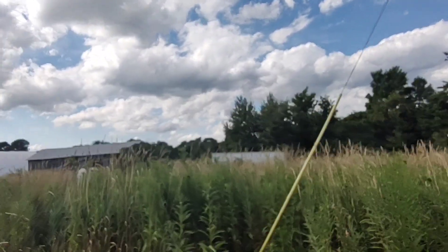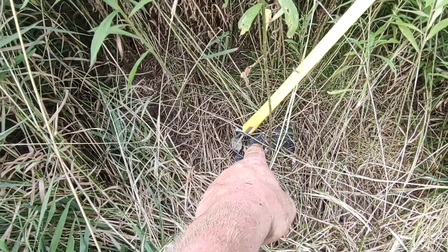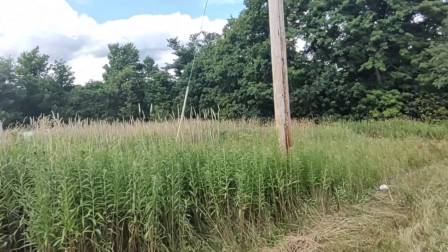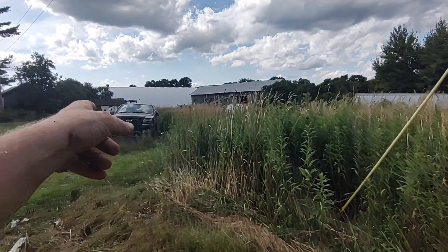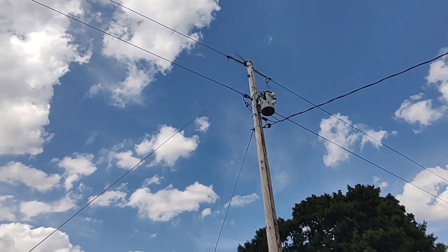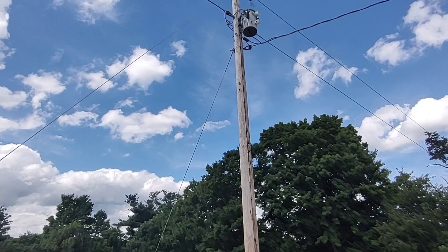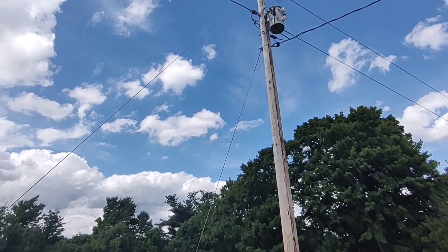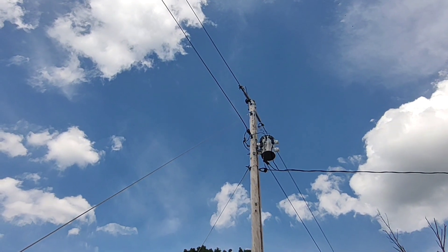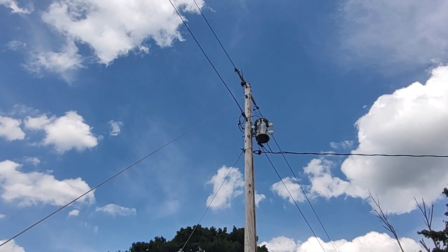I was playing around with my meter the other day — if I stick my meter ground into the ground and touch that cable down there, I'm getting a half volt. And 0.25 volts is what affects cattle. I don't know if this is feeding something off the line into the ground and I'm picking it up through the barn. When I talked to a guy at Penn State last year about stray voltage, one of the things that could cause it is loose connections and corroded connections in fuse panels. To me, that up there would almost be a loose connection — if they're just touching in the wind they could bounce back and forth.